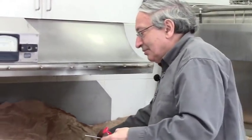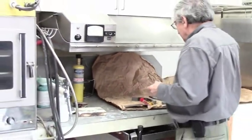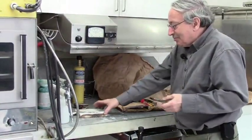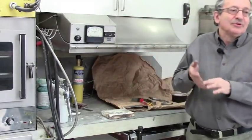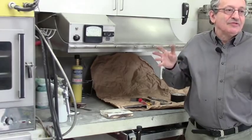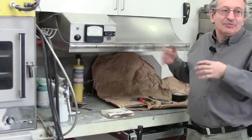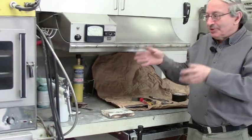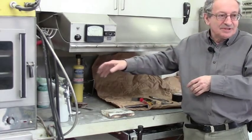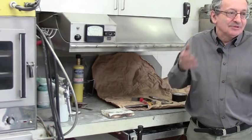Now, the second way to get the wetting, which is not as effective as sandblasting but sometimes simpler to do, is to heat everything to about 250 to 300 C. And that's easy if you have a big oven for painting, which you need anyway. So you put it in the oven before painting, heat it up, spray paint it with a powder, as we'll see, and put it back in the oven to cure. So the equipment is there anyway, you may as well heat it up.